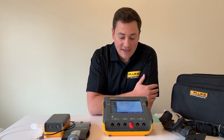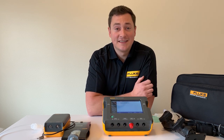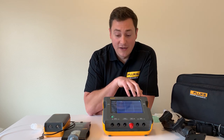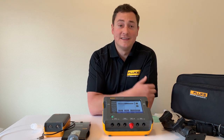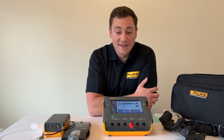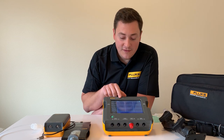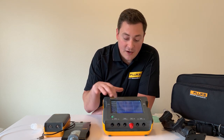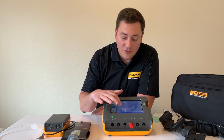You can save from any screen by pressing save, and that's going to save it to a test ID — which is the asset ID of the medical device you're testing. If you go to menu you can configure that and type in whatever you want. The other nice feature is test profiles. A test profile is the brand and model of the medical device you're testing — in this case I called it a Philips V60. In setup you can configure your gas type, correction mode, and units, and save it all under a test profile.